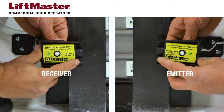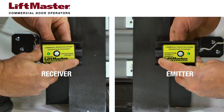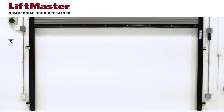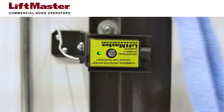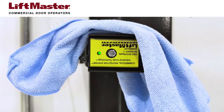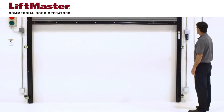Align the photoelectric sensors until a solid green LED is achieved on both the sending and receiving sensor. Test the protector system to ensure the second set is working properly. Open the door fully and obstruct the sensors. Both LEDs should begin blinking and the door should not close when given a close command. Remove the obstruction, and the sensor LEDs should revert to solid green LEDs. The door should now close.